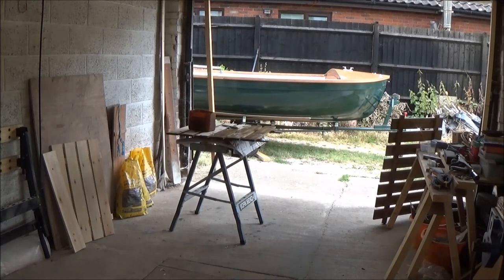This is an idea I got from Roger Barnes, who has a wonderful little sailing dinghy of French design. He creosotes the floorboards on his boat rather than varnishes or oils them, because if they get wet any varnish on them will be slippery. Creosote's a nice usable sort of finish — it dries and soaks into the wood, and like linseed oil can be reapplied at any time. So it just seemed to make sense to have a go at that as well. It's a lovely warm day.